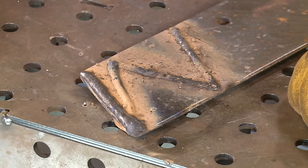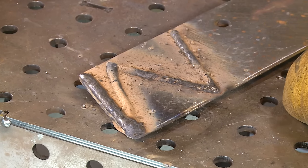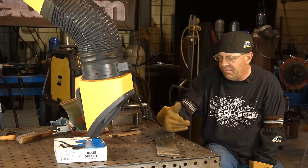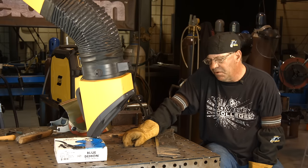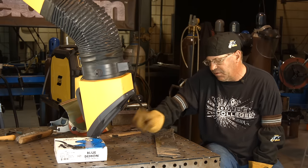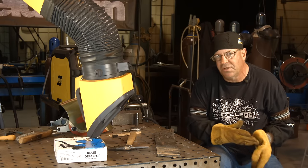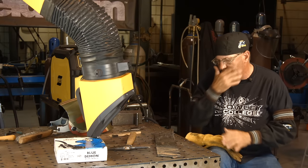So I see some definite advantages. If I was doing a bunch of patterns and doing some buildup with wire and I didn't want the expense of the gas, or I was doing something fairly portable, I'd grab this stuff and go to town with it. Again, the wire chemistry itself — chrome, manganese, tungsten, molybdenum — gee whiz, that's some goodies in there in the presence of carbon. So you know this is going to get hard.